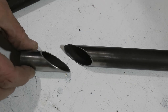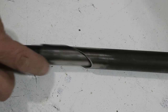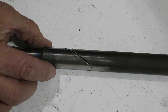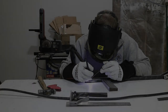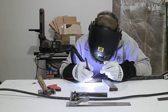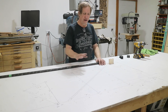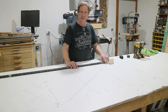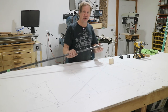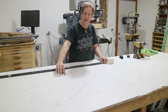I got these two cut and cleaned up, and to hold them in place I'm going to put a 3/4-inch tube through here, then tack them in place and weld it. So I'm just getting started on the horizontal stabilizer — the second one; I've already built one. Got my print on the table, it's a little marked up from the first one. Got my leading edge tube with the scarf joint done and the thicker material added on the nose, and I'm going to start bending it right here.